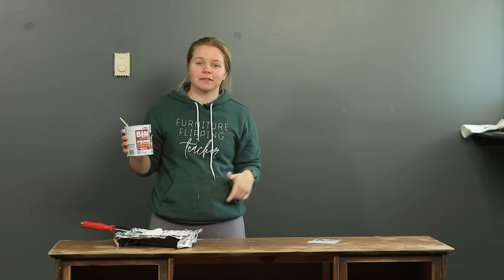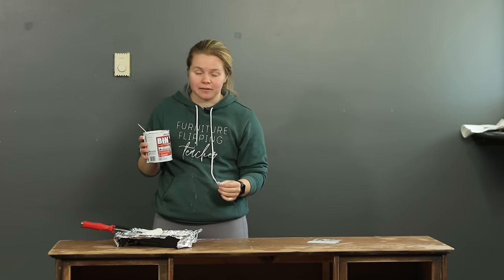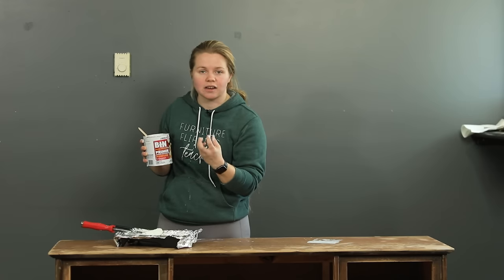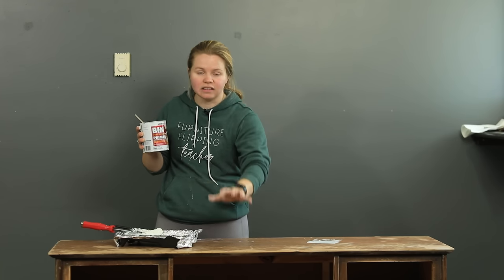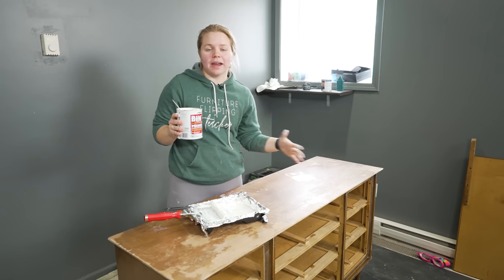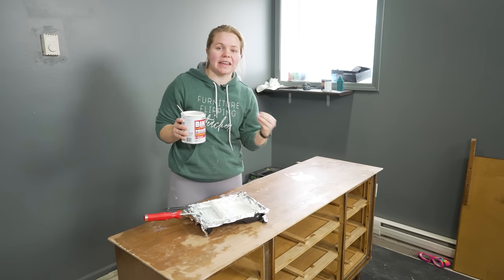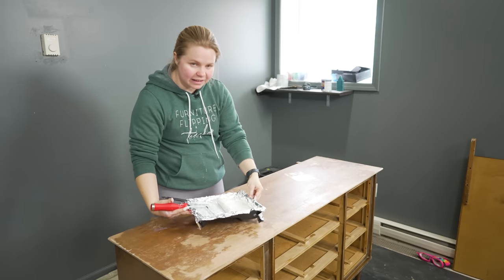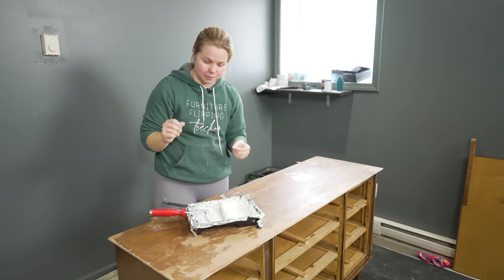I also did a scuff sand over the entire surface so now we are ready to wipe off the dust and prime. It is time for primer — I'm going to be using my favorite BIN shellac-based primer. The reason I'm using primer is because when I was sanding I definitely went through the finish, especially on the top where a lot of areas had failing, cracking finish. The primer is going to block and lock that in so the color doesn't bleed through later. Primer is always a great step — it ensures you don't get bleed-through and that you get the utmost adhesion with your paint. I'm using a 3/8-inch nap roller, and a little hack is to line your paint tray with aluminum foil for easier and faster cleanup.